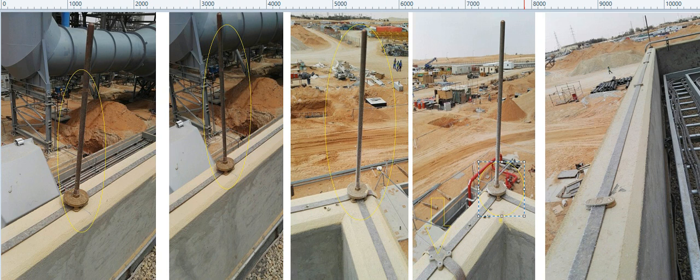This is the installation of the vertical air termination rod with the horizontal air termination. This horizontal air termination flat is running on the parapet wall, with flat connectors and clamps. Here is the vertical air termination rod. This lightning protection network is running over the building parapet wall. This is how the lightning protection system is implemented at site based on the lightning protection system design drawing.